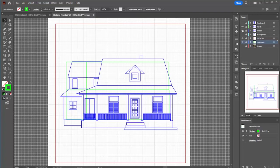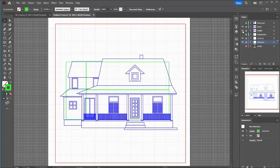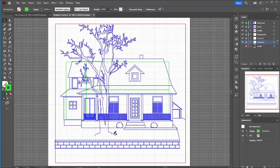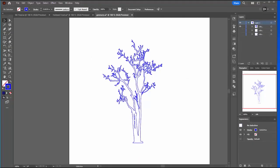I wanted multiple layers, so I put the porch on a separate layer from the body of the house. Each layer of wood I want to cut needs its own layer in the drawing. Everything is drawn in blue for engraving, but eventually I had to change lines into both cut lines and engraving lines. The detached garage on the right-hand side goes on the very background, and the foreground has the yard and the engraved address. For the tree, I found clip art of a similar tree, modified it in Photoshop, flipped it horizontally, did an image trace, and ended up with the final result.